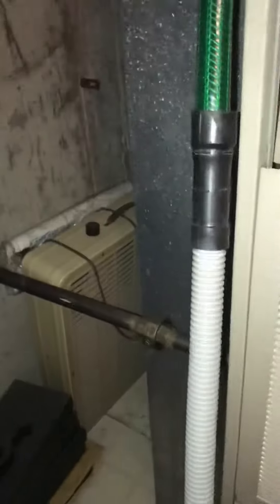This is a newer house, so looking at the electrics — you can see that's in a sleeve, so that's good, meeting code. And then with our gas, we have an isolating valve with a drip, so that's in good shape.